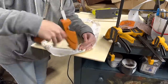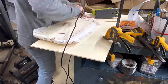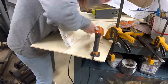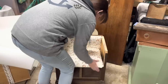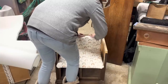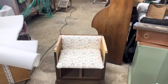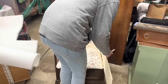To attach this, typically you'd see me use staples — that's really the best route to go. But here I'm using super-strength industrial Gorilla Glue sticks. It adheres to everything and actually worked really well because it kind of seeps into the fibers of the wood and into the fibers of the fabric. I would not recommend this if you were going to sell the piece — only if you're making it for your kid or someone in your family. I like to make sure pieces I sell are going to be lifetime quality. I'm just getting a fit first, not attaching anything yet — figuring out where I'm going to place everything. The side portions can now be figured out because the cushions are on and I can see how big I need the side pieces to be, and they'll get the same treatment with foam and fabric.